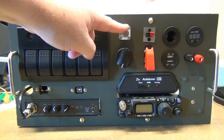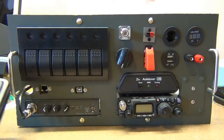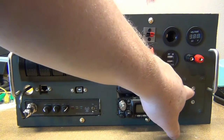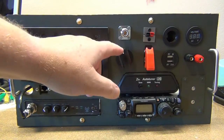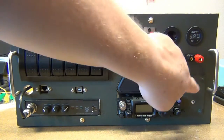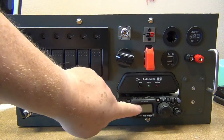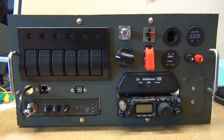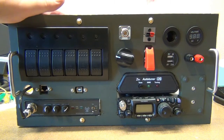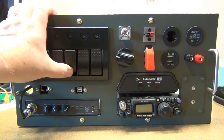We could always use this other output, but this will be the main one. Since I couldn't mount the speaker in the rack, I took the audio from the Rig Blaster and ran it over to this jack here, and I put an L-pad in between so we can adjust the volume for the speaker independently of the radio volume, to make digital work properly.